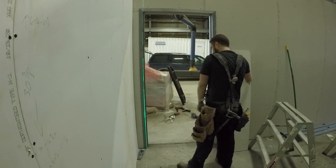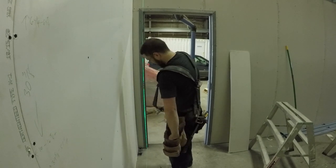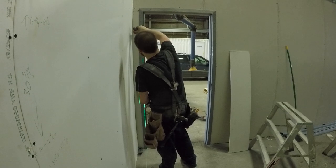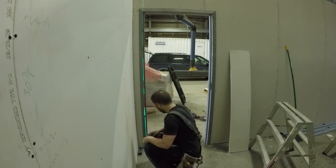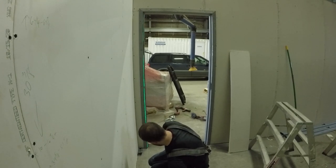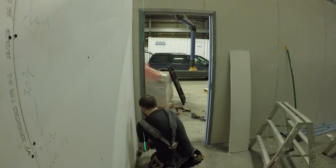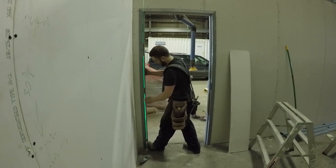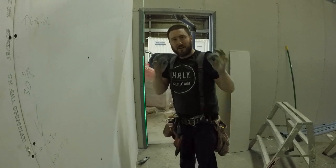You want to use the lifter there to lift it if there's any space between that and the top buck piece. And boom — see that? Nice and tight, mint. So what I'm going to do is screw down the wall stud that's locked into the corner here first. Then double check and make sure everything's good on the inside, because there's no bottom spacer bar at the bottom. This one I do have to move in a little bit at the bottom. I always put a screw in the bottom track — even on these little pieces I always put one there in the middle. Kick that in there, boom, make sure it's good and it's mint. Then screw it off.